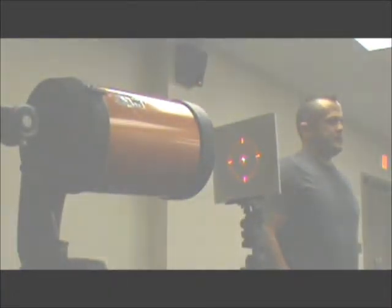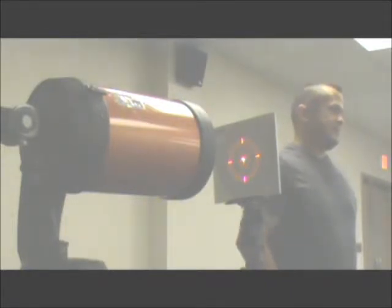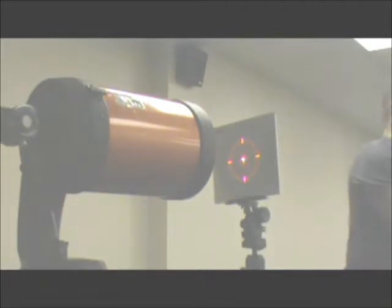Axis, so it is critical to load it properly. Make sure the reflector mirror is flush against the opening. See, that's a nice focus. Proper registration. But this adjustment that they're going to do now is to the focuser. That's why they're removing the front mirror, the secondary mirror. Then we tilt the focuser, yeah.